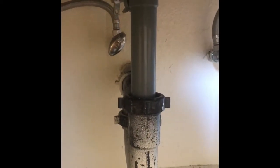Quick look at that. All right, guys, I'm doing the last bit, which is the pressure test. You want to fill up 3/4 of the bowl, a quarter of the bowl of water. That should be fine for 5 minutes. We're testing if there's any leaks. So far, nothing. Before you do that, I had some excess plumber's putty.